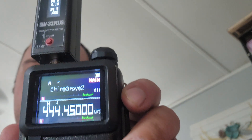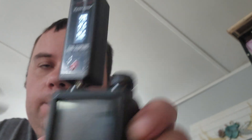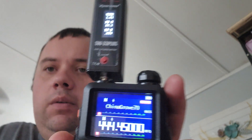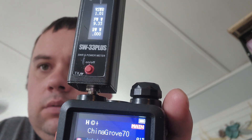Now I'm gonna try a repeater, to see if there's any difference. Let's try keying up here — you don't want to hold it down too long, you don't want to put a lot of stress on that dummy load. Yeah, it's 10.1. All right, same on 70 centimeters — that's the same on 70. That's not bad at all.